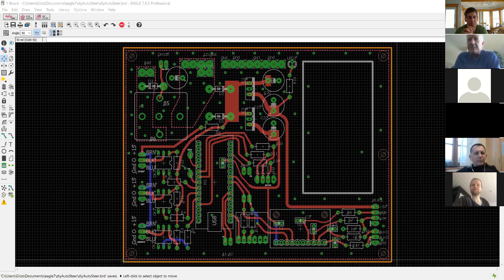That's why I modified the circuit — made the pads for the resistors and diodes bigger so they're easier to solder. Let's make the board an inch bigger so it's easier to put together, not so crammed. A board an inch longer will still fit in your tractor cab. If we really wanted a small board, we'd eliminate all the little sub-boards and make the whole thing surface mount — five centimeters by five centimeters — but that's not the point. The point is to build stuff, have it work, and learn.